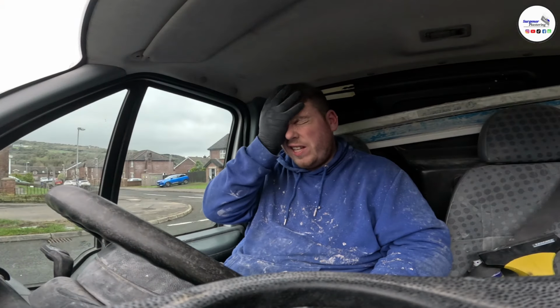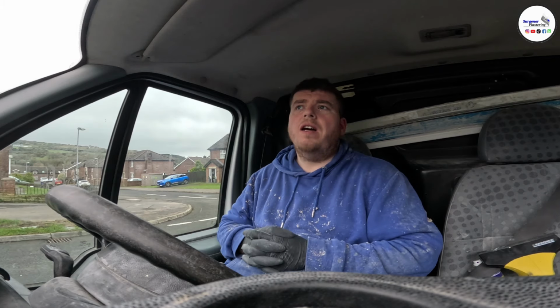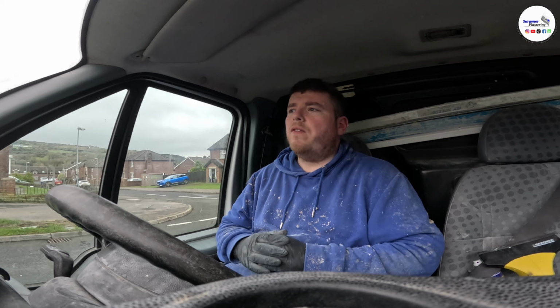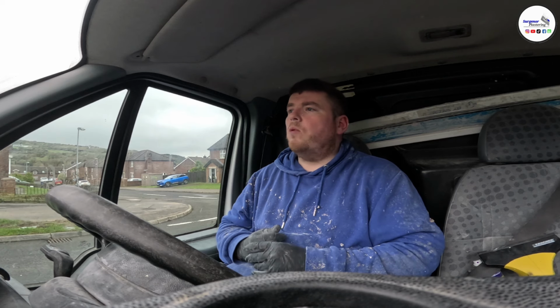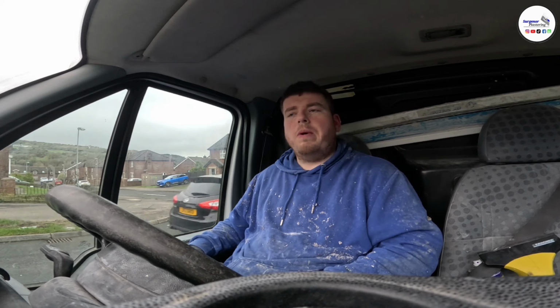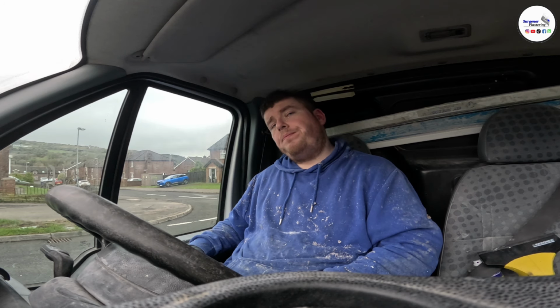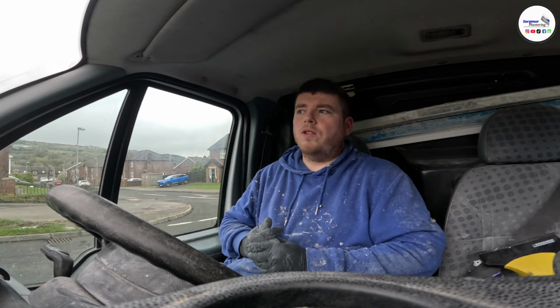Okay guys, so that's us finished. As I was saying, it's my cousin's house, and I skimmed probably another 7 ceilings, and they're all stippled. It's not stippled, it's like a wave effect. And they've all been dead on. The reason I knew they were okay to skim over is that it was me that did them, so I knew they were going to be rock solid, there was nothing underneath. Plus they're relatively new houses too, built in the late 90s, early 2000s, so they're rock solid.